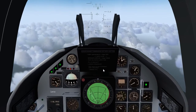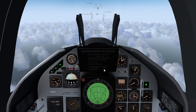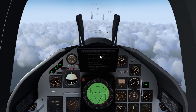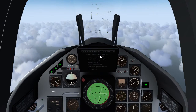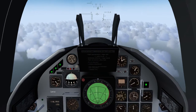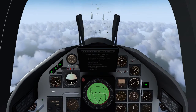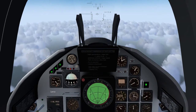A DC power outage will decouple the autopilot with no warning. If DC power is restored within 6 seconds, the autopilot will re-engage at its previous setting. After more than 6 seconds it stays off and must be manually re-engaged. If in mode 3 altitude hold and flying in the transonic regime for more than 60 seconds, it will disengage and downgrade to mode 2.